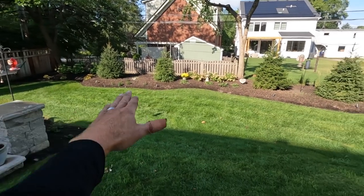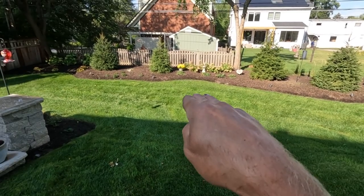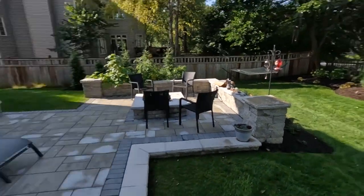Now it's a very flat backyard, and through here we've got a little bit of a drainage swale, so we're actually going to dig that basin into that hillside right there and then build our waterfalls coming out of there. And what I'm hoping to do is, we've got a SLD 5,000 to 9,000 gallon per hour pump and some beautiful moss rock. What I really want to do is get a lot of movement, splits, and then maybe a big veil style waterfall, because it is so far removed from the house and so close to the back property line, I want to make that thing as visual as possible, it being so far away.